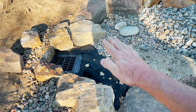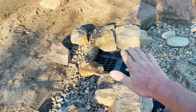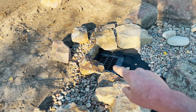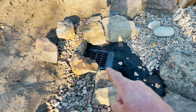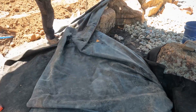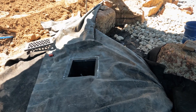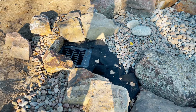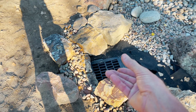Before we put the liner in, the soil is bermed up at an angle, so we create this kind of beachy area coming in from the deeper water. Then it's a big flat that's tamped out right exactly where we want it, two inches below water level. Then you've got this drain box that is dug into the earth straight into the dirt. That thing goes and the drain runs back to where the drain runs to — there's a four-inch overflow into the drainage system there. Then the pond liner comes right over top of this drain box and the drain is simply cut. It's a compression fitting. Even if it leaks a little bit right there around the edge, it doesn't matter because it's at water level, but it's not going to because that lid is compression fit down into the liner. The box has basically got the liner sandwiched in between.